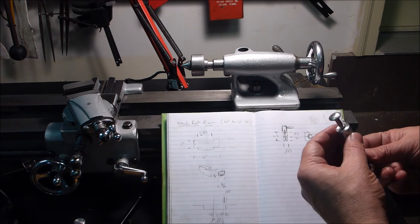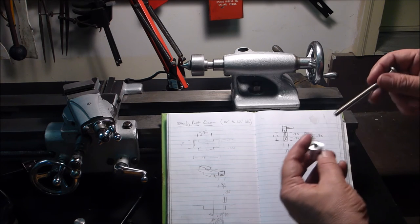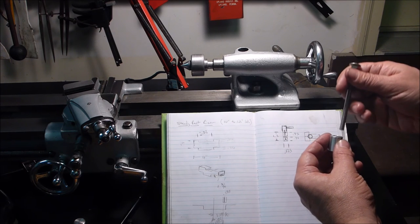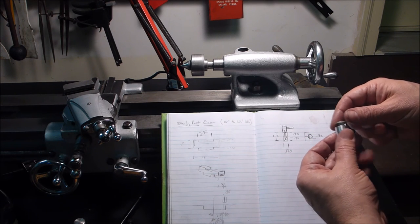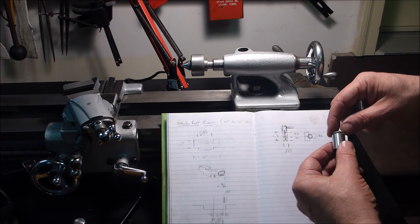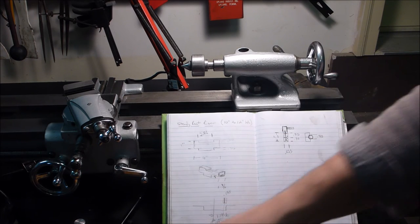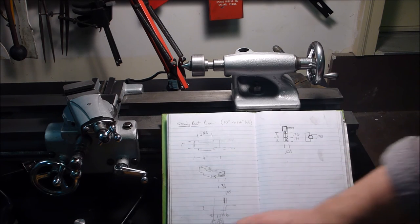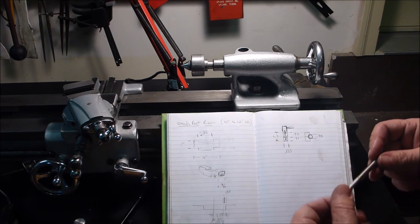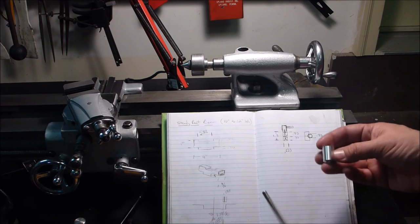And so I got a quarter inch bore in here to take the quarter 20, and then I went slightly oversized to like a 5/16 to make room for this to jam in, and I'll seat it when I'm ready. Right now it's, you know, it's started. So that'll be the captured bottom. I'm just using that because that's what I had around. That kind of dictates a lot of my design work, is what do I have around.